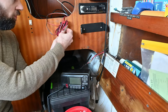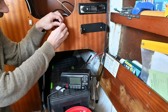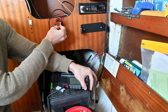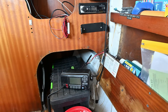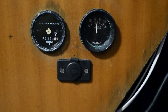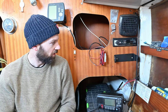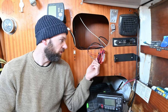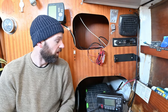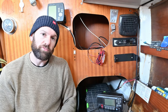There is a fuse — I've checked it before and it looks fine. I bypassed the fuse and it still doesn't come on. How bizarre. I checked the boat has power: the voltmeter is reading about 12 and a half volts. So that was a complete failure. The fuse is fine, these connections should be fine — even if there was no solder, the wires are at least pushed together. The multimeter is still reading crazy readings and the battery is at about 12.5 to 13 volts.